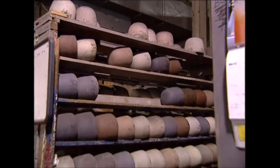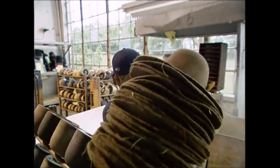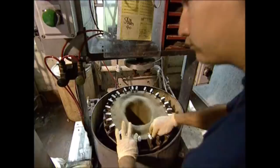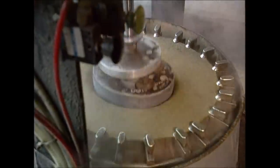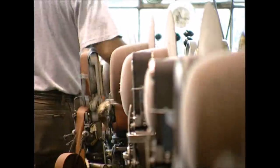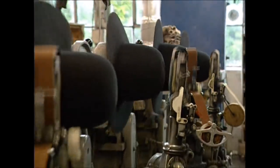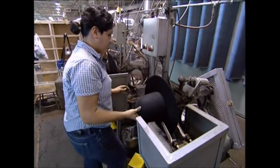As well as its shape, the hats also need to be made in different sizes. There are very few cowboys today who'd be able to fill John Wayne's boots, let alone his hat. Each one goes into one of these machines which will use a combination of grips and hot steam to pull it out wide. Once stretched, a sizing block is inserted and the machine presses it into place. Although they work in a tough environment, the traditional cowboy hat has a soft velvety texture to it. Here, freshly made hats are being sanded down. The production processes have roughened the material, so the sanders are used to produce a soft and delicate texture. The only downside is that the sanders leave small felt balls on the hat surface.